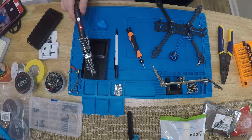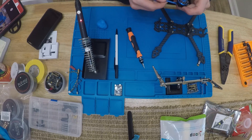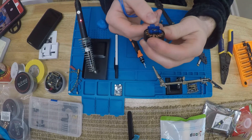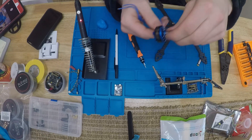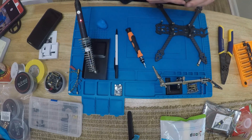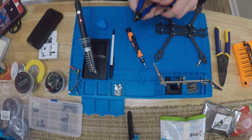The soldering iron is warming up - red light, getting up to temp. We're still getting into this but we'll get there. Just a tip: in Betaflight settings, you can count the magnets on the outside of the motor - 14 poles. You'll see that in Betaflight settings in a few different places.